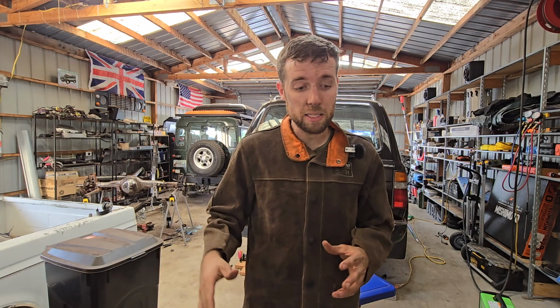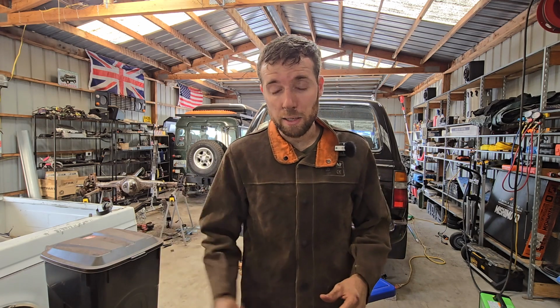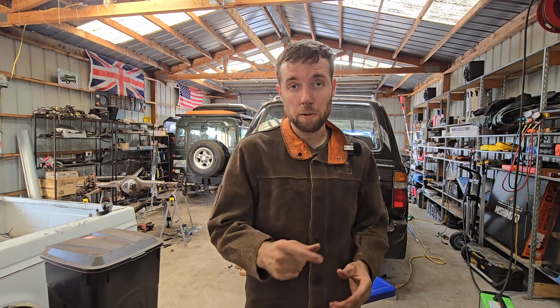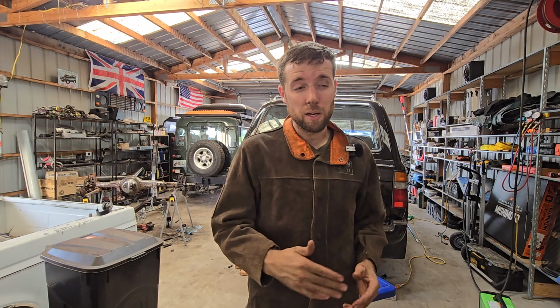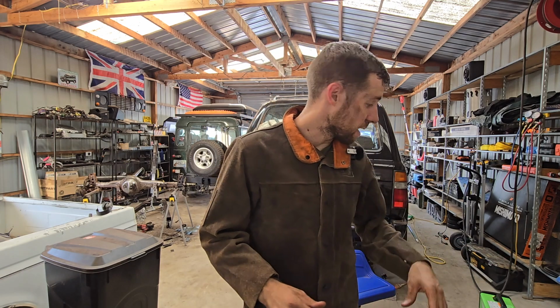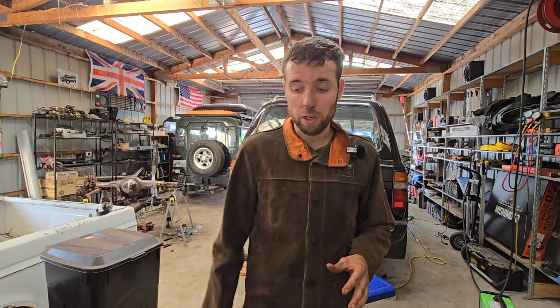It's going to come out a little messy, but if you're trying to just hack something off that's a big piece of steel that you would go through 1,000 cutting wheels with, this plasma cutter is excellent. I have it nowhere near peak power, and I have a lot more air power to go as well. And I don't even come close to needing it. It blasted through this 1/4 inch steel.